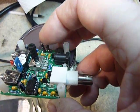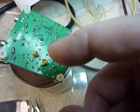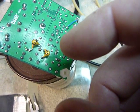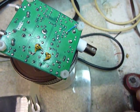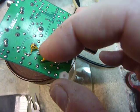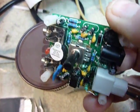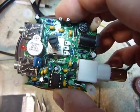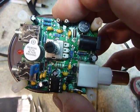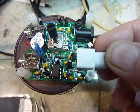Now some of the crystals I have did not oscillate when I put it on 80 meters. The thing is that this oscillator requires different size capacitors in the capacitor network that connects to the crystal. It has 100 picofarad and 100 picofarad — these are on top of the circuit board. What I did was tack-solder a 47 picofarad at one location and a 220 picofarad at the other location. That goes across those two capacitors up here by the crystal socket, and those then allow all the 80 meter crystals I have to work, even the FT-243s. So I made up a crystal adapter.